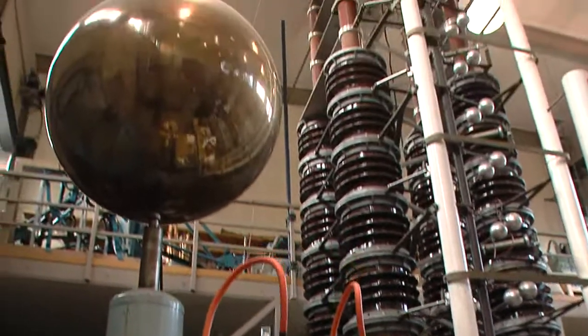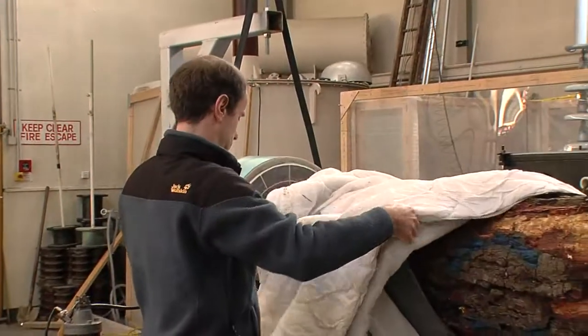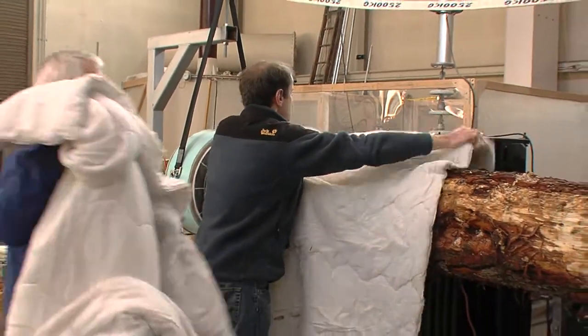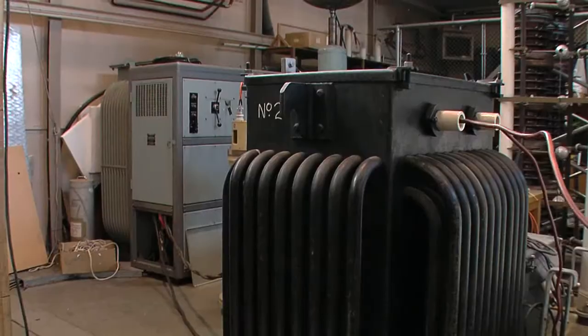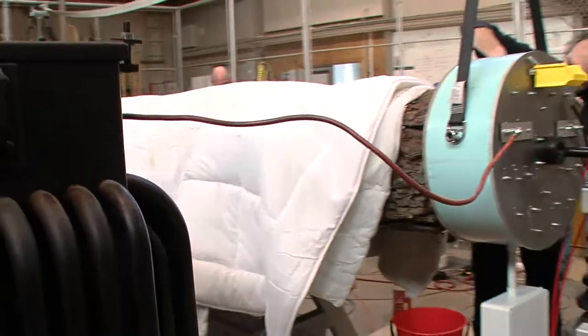With this technique, which is called Joule heating — after Joule's effect of resistive heating — apart from some tiny losses in the transformer and so on, all the energy is dissipated in the wood, which is exactly what you want. It's just like a one bar electric fire; all the heat's going into the element.